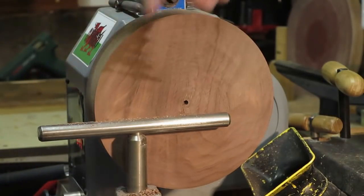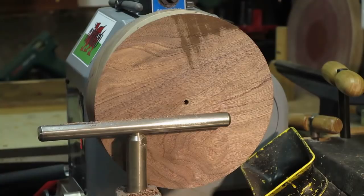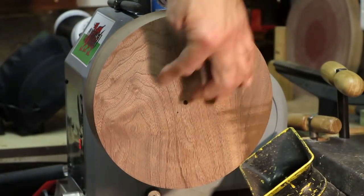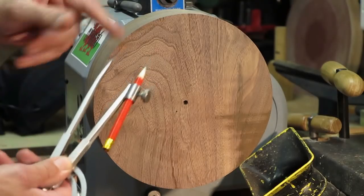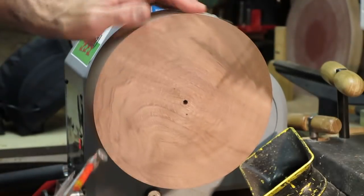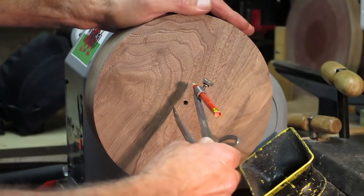Okay, so now the main reason for doing this is to clean up, because I want to draw some circles on there, which will become apparent in a second why I'm doing that. So we'll now go, imagine 75mm around here. What I'm going to do, I'm keeping, this is the radius of my faceplate. Okay, now there's the centre, that's much larger than I would have wanted, but nevertheless that's the centre of the blank. Now I'm off that little hole there, or that little mark there, is the offset. Now I'm going to do a 15mm offset.